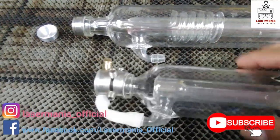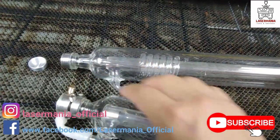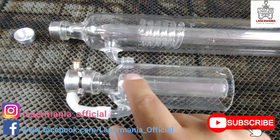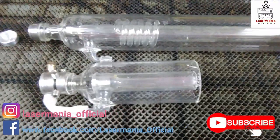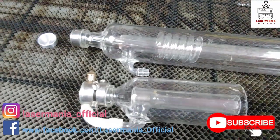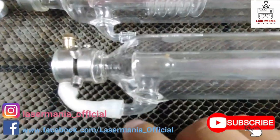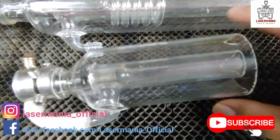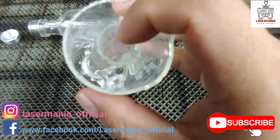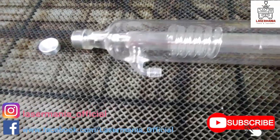Something I've noticed is that this port also goes around the lens of the tube to cool it down. The water goes there, passes through the little hose, and then goes across the whole tube to keep it cool. It exits through this port right here, goes back to the chiller, and comes back again to do the cycle. You can clearly see that this port goes into the middle tube — because the inner tube is the one that carries the actual laser beam.